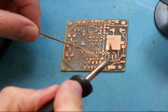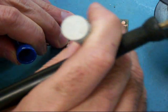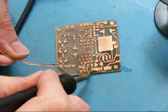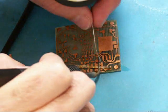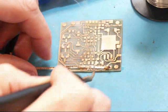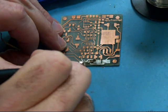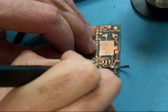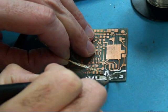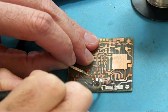I'm going to apply flux from the pen onto my board and onto my wick. Then I'm going to take and apply solder to my wick until it's saturated, and then spread that around just in the areas where I have the flux. Trying to keep the solder from piling up — we just want a thin layer. What's nice about the wick is that it kind of keeps it from building and blobbing.